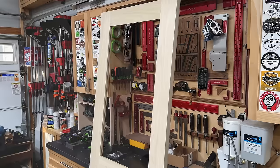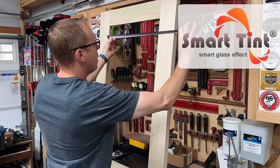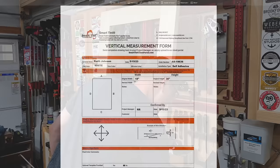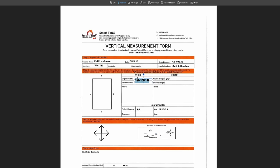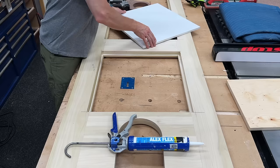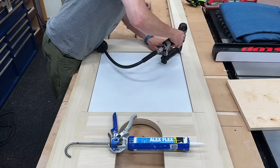As much as I want to finish that cat door right now, we need to move on to what I'm calling the magic film — the Smart Tint film on the top window of the door. This will allow me, with a remote control, to either frost the glass or make it clear, giving me privacy glass. To order the actual film, Smart Tint sends you a form to fill out with your rough dimension openings, width, height, and which side you want the wires to come out of. When it's clear, my wife or whoever will know he's recording — come back later.